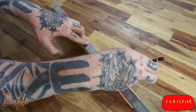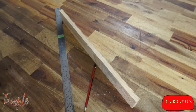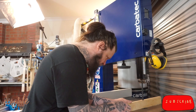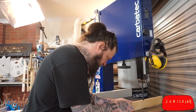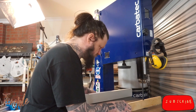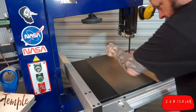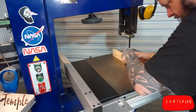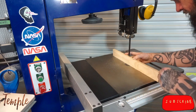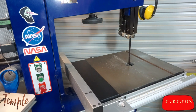Draw a line down the length of a piece of wood that you'd like to test with. Run that wood freehand through the blade. Try to stick to the line as best you can. Stop before you finish the cut, kill the machine, and hold your workpiece in place. Once the blade has stopped turning, unplug your machine. Using the workpiece as a template, draw a line on the table with your pencil. Once the line is drawn, you can remove your workpiece.